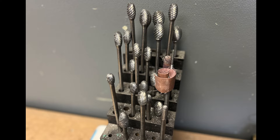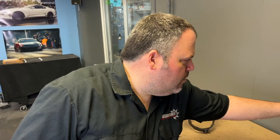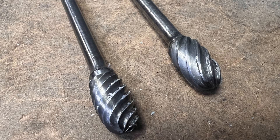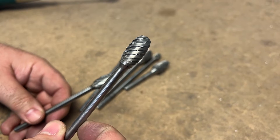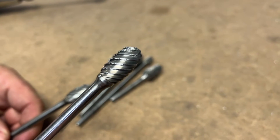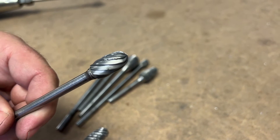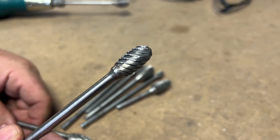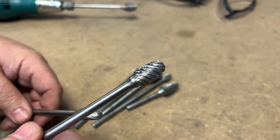There are many different shapes and sizes of burrs that I use. It depends on what I'm grinding on, what shape I'm trying to make, and how hard I'm going to be pushing on the burr. First, I'm going to show you the difference between the HeckGames burr and what other people sell. This is a HeckGames high helix burr. If you look at the shape and the amount of cuts and the way that it spirals compared to the generic one, the difference is that the generic will leave big chips, making it harder to sand. Whereas this will hog material and leave it very fine. You can even slow it down, as I showed you on the electric grinder, to make it even nicer.